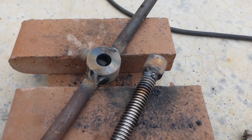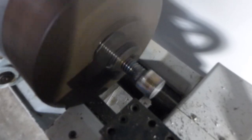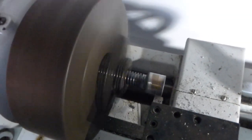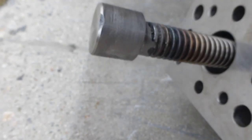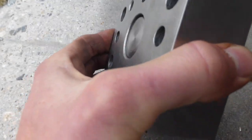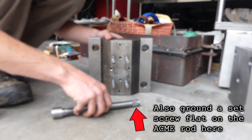Welding the handle together, and welding a piece of one-and-a-quarter inch round stock that I drilled onto the end of the acme screw, then turning it down in the lathe to make it look like a big marshmallow on a stick. That fits in the ejector manifold like so. Now time for final assembly.